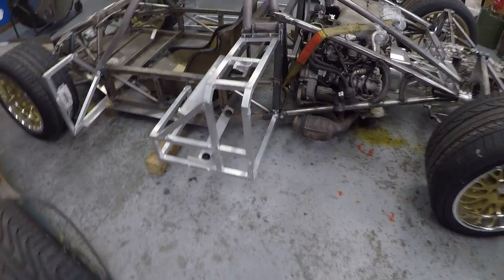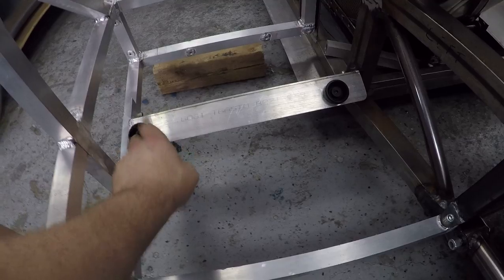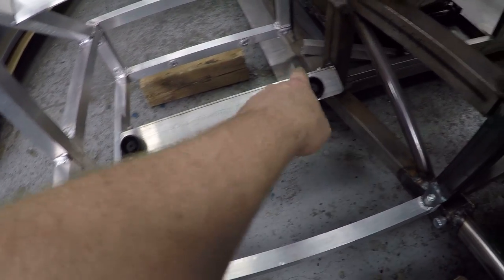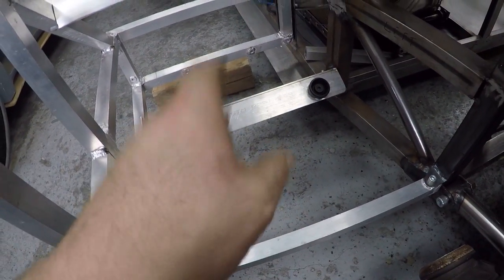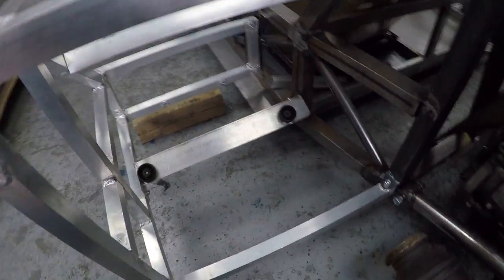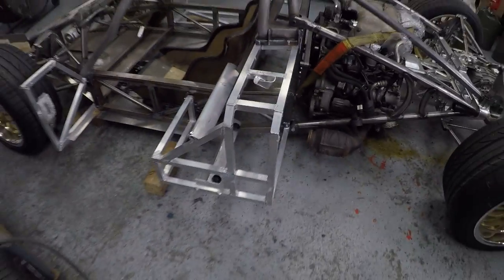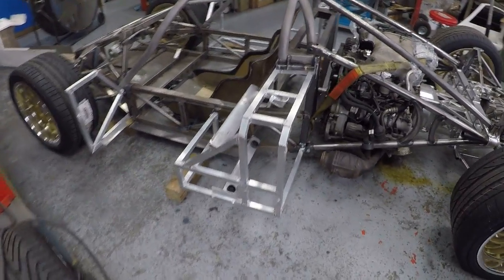Pretty much the radiator top position here is fixed, and then this plate here with the other two radiator supports actually bolts in. So you lift the radiator into position and then bolt that in from there. The radiator is at least fully rubber mounted so I won't be having any problems with that.